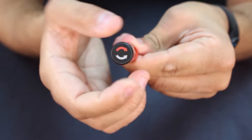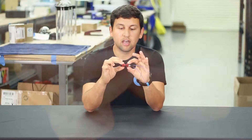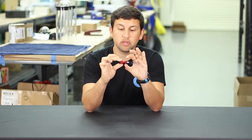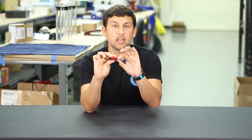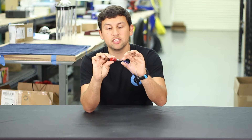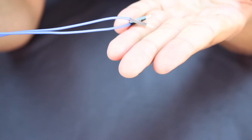On the front here is a dial. You rotate it to the right to turn the switch on, to the left to turn it off. It has a standard penetrator shape and nut and O-ring on the back. At the back is a button that is the actual electrical switch that can handle up to 5 amps. Attached to that are two wires with header pins attached for convenience.